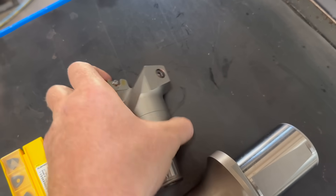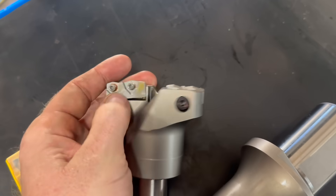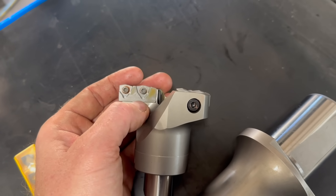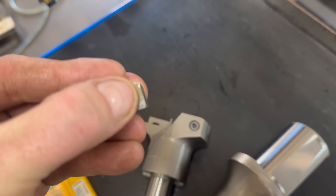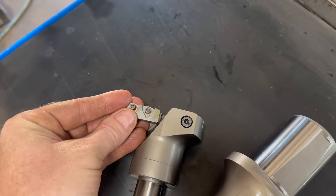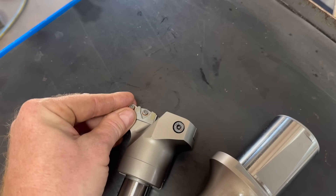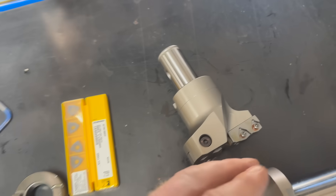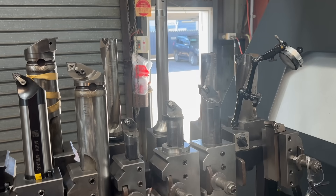You can see how the head here goes together — that's your inner cartridge that cuts the inner. Now your outer cartridge here is how it can be 80 to 84mm. I actually need this thing to cut at 81, so what I'm going to do is take this cartridge and just mill — in the little mill — a mill and a half off the inside, which will decrease the diameter that this cuts by three mills. So it'll go from cutting 84, in its current form, down to 81, which is what I want it to cut at permanently. That's how you alter them. The pilot drill has to be set at a certain length, then we put it all together, swap it out in the tool holder, and off we go.